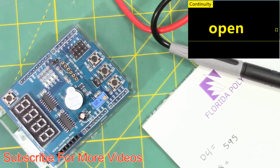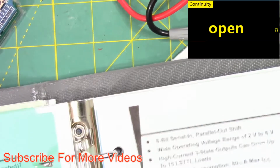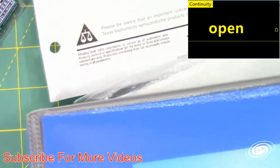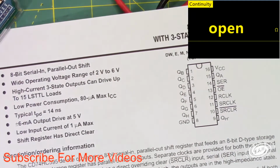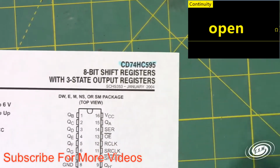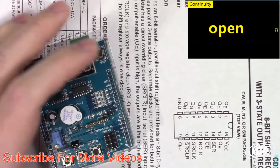I happen to have a book of my commonly used data sheets. Let's just find the 595 shift register right here. Boom, we're gonna find out what pin that is. This is why I keep the data sheets. Alright. So let's orient this in the way that it was on the, let's try to go down here. Okay, so let's get this back in here. So let's see if we can go this way with it.